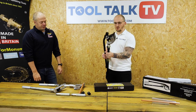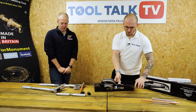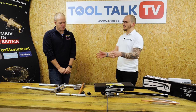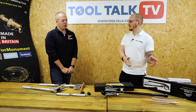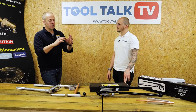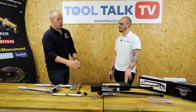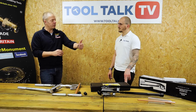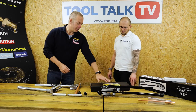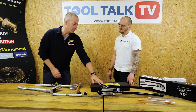That is a lot heavier than it looks — but you are looking at someone who works on a laptop all day. That is a heavy bit of kit. So just tell me about the use case. When someone's doing an installation job, do they tend to be mixing between 15 and 22 on the same job, or are some jobs predominantly one size? The majority of internal fittings within a house — to rads and to taps — is going to be 15. But when you're bringing in feeds, you're going to be bringing it in 22. So it's not a 50-50 split; there's almost certainly more 15 than 22, but you might just be on a job which is 22. So part of the advantage is if you're only doing 15mm runs, you don't need to carry around a big heavy combi bender — you can just carry around your 15mm bender.